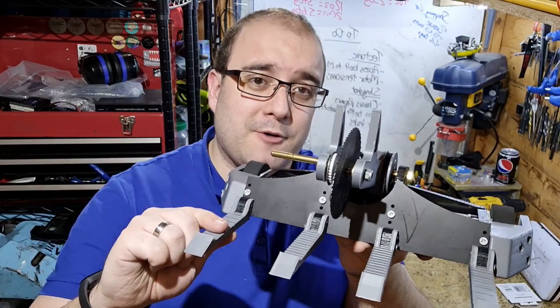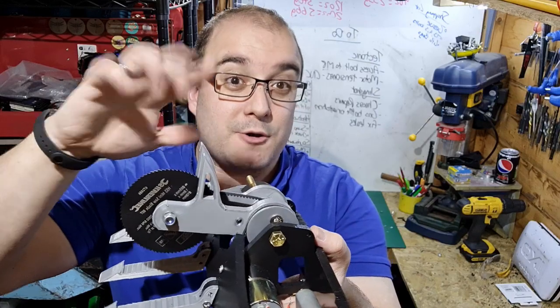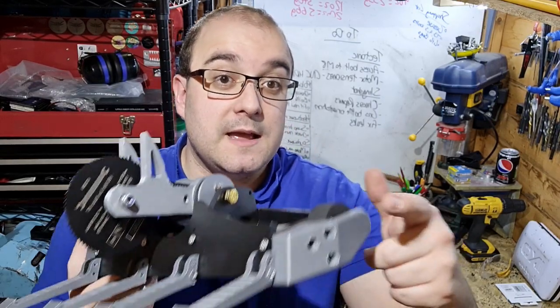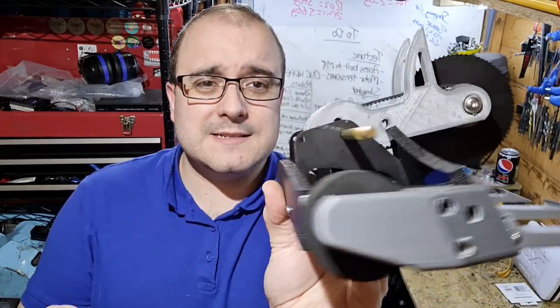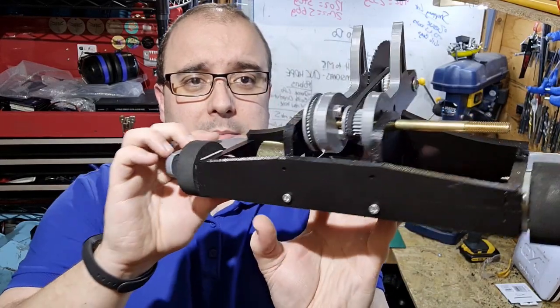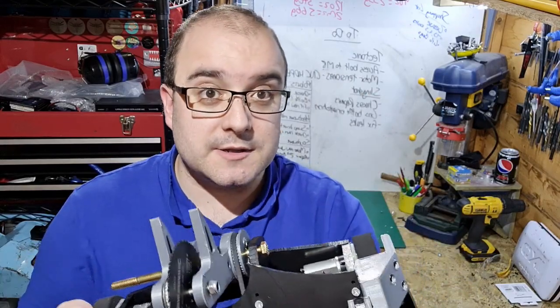So I've got the PLA prototypes for the forks, the side armor, and don't forget the weapon arms are still prototyped PLA as well at the moment. These will eventually get machined out of HDPE, and the other bits will all be made from TPU. But how cool is this looking? I've only got a couple of screws holding it all in at the moment, but it's looking great. I still need to machine the base and the lids. I'll do those a bit later on.